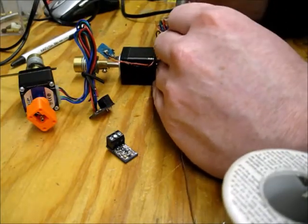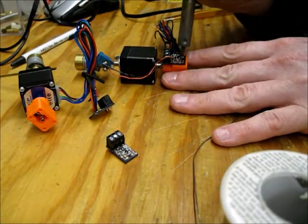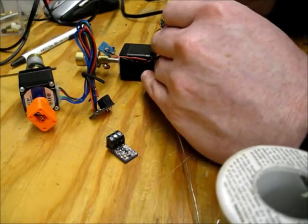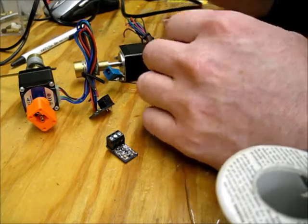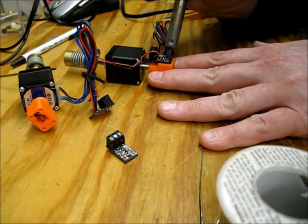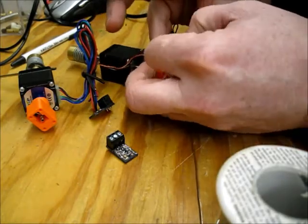on long enough for the solder to wick down the barrel and get around the pin, heat the pin, and make a good joint to the pin on the sensor. So I throw some solder in there. You can't see anything because of the hand. So there, the barrel's full of solder. And I just hold it there for a while to make sure everything's nice and hot.